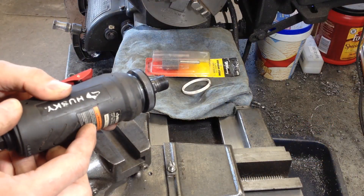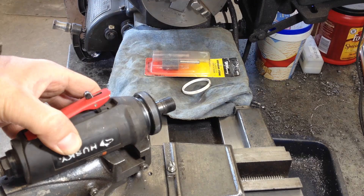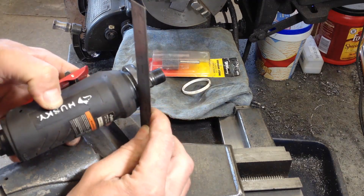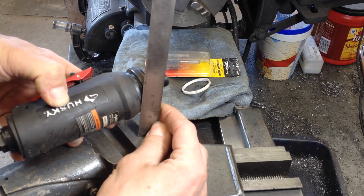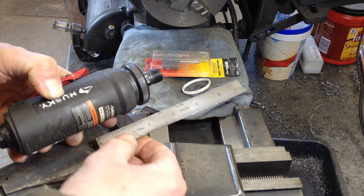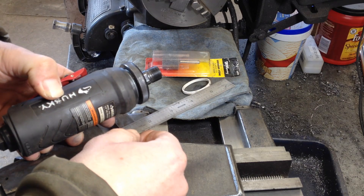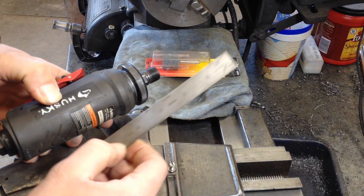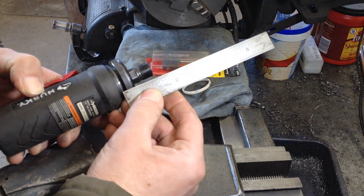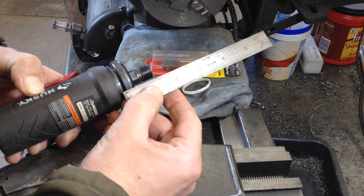The part needs to set forward on the tool post so I have clearance here. It would be kind of nice if that was three inches tall so I could clear that, and two inches that way should be enough. So if I had a piece of angle iron that was two by three by... oh, that looks like eighth of an inch.